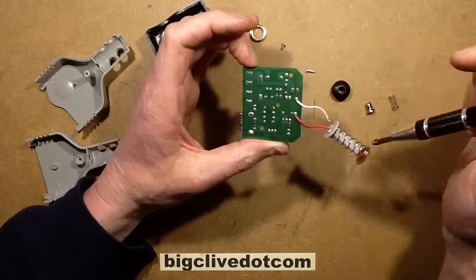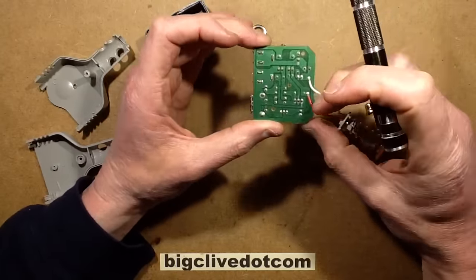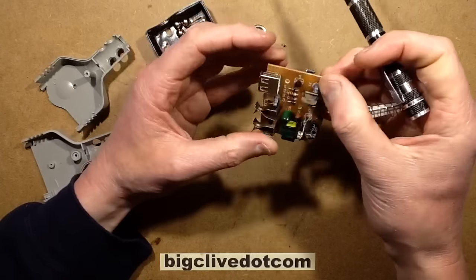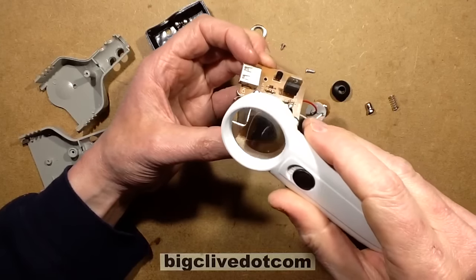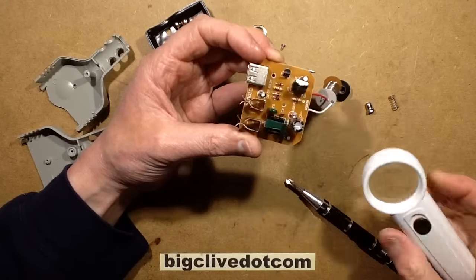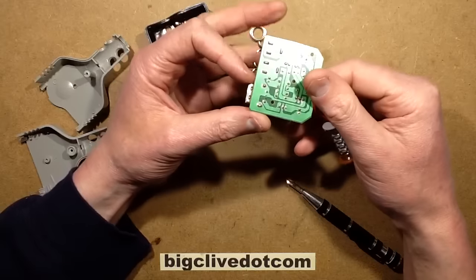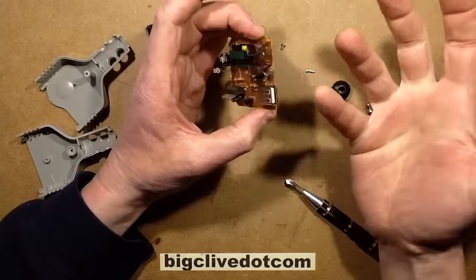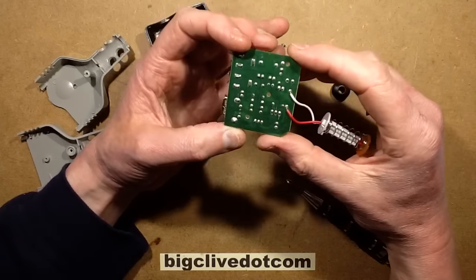It couldn't, because it needs to be regulated. The USB power supply is going up to that little transistor thing which is a 78L05 — that's rated about 100mA best. That's not going to give much power output on this USB output at all. But then again, why have they even got that if people are going to be plugging their other USB adapters into it? How odd.